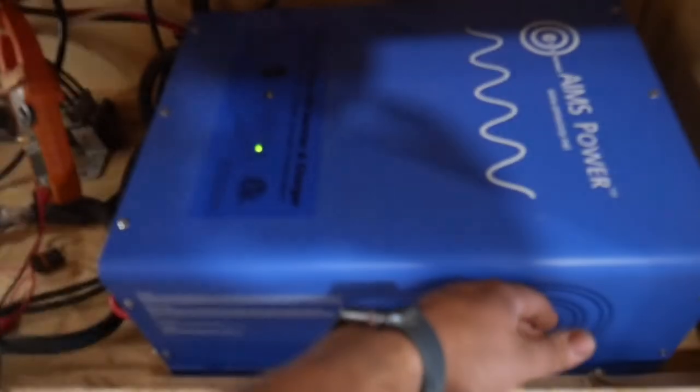Input voltage is 22.7 volts. I've got to have all my hands here. And that was it. It said that was too much. So I rebooted the power inverter and turned the water heater off. The three air conditioners seem to be about what the rating of the inverter is, about 50 amps, about 6,000 watts. I didn't really expect to run three air conditioners off the power inverter. There's just not really enough DC capacity or ability to get that high an amount of DC to the inverter long term.